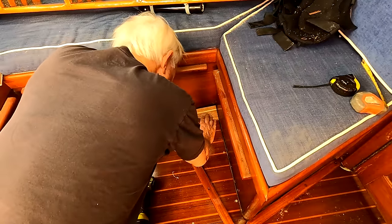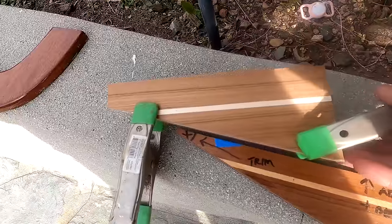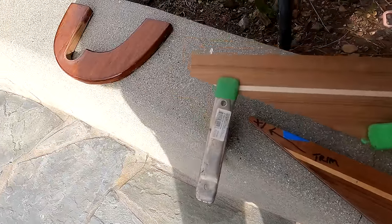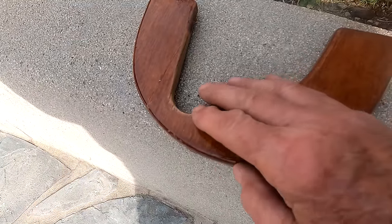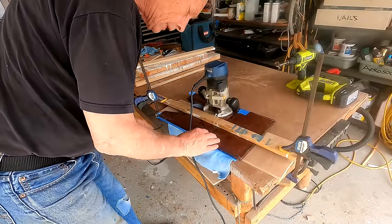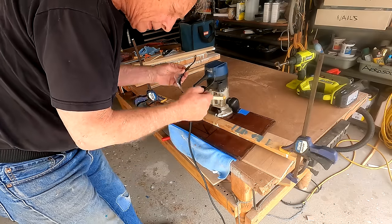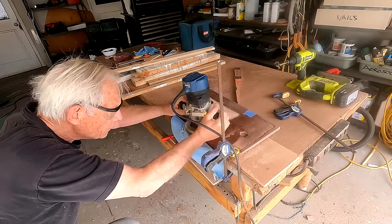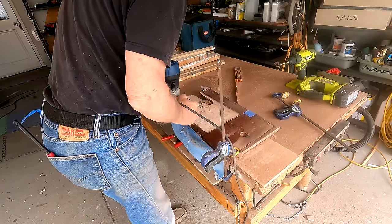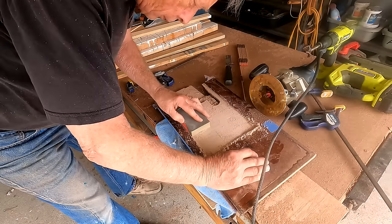Oh, I see there's no trim piece on the top. The previous filler piece for the triangle was carved out of a block of solid teak, so this will have to do. It ought to fit right in there — I can use some construction adhesive to firm it up. I've had to modify this collar because I couldn't get the wire to fit without it, but that's easy enough. There are some other funky parts including this cover, which I'm going to have to relieve the back of because the boat's not exactly flat behind the base of the mast because of the mast step.